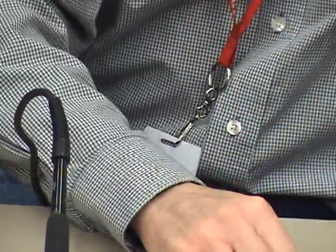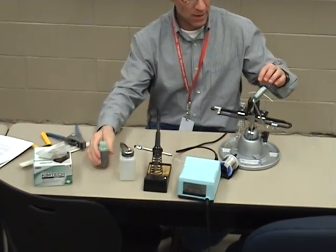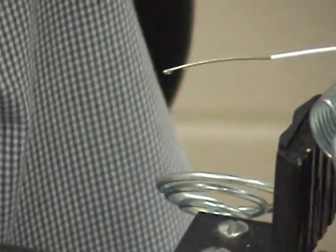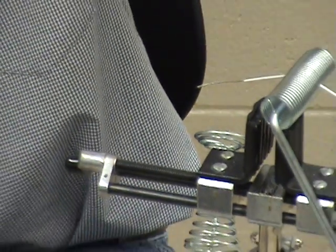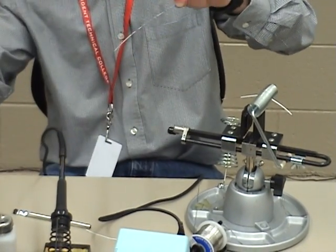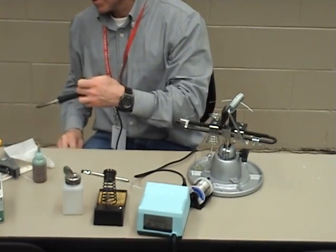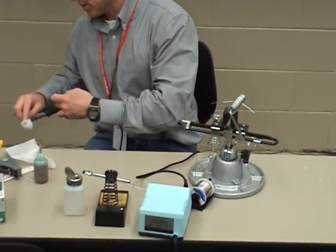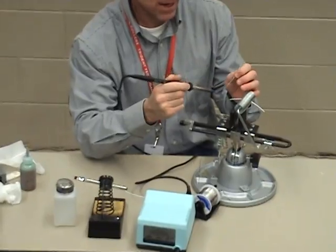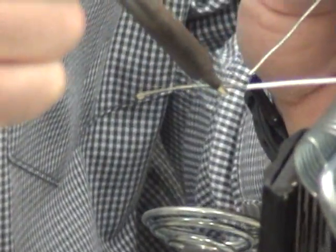Lightly clean them so you don't mess up the strands. I'm going to lay it up — lay it in here. Then flux, our favorite. Remember, you got to cut the solder so you don't pinch off the core. You want that rosin core flux center to flow. Clean it with alcohol using chem wipes. Then you got to clean the iron — take a dry chem wipe. Lightly tin the end of my iron.